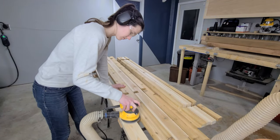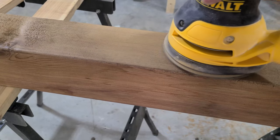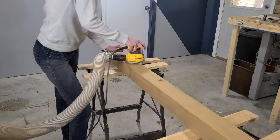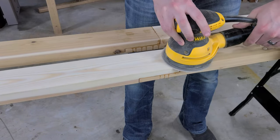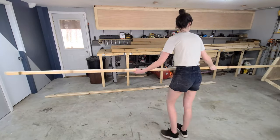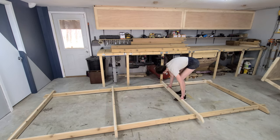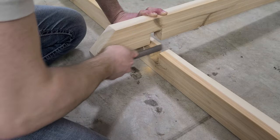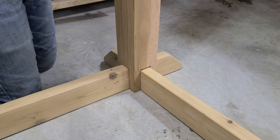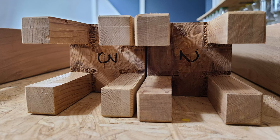These cedar boards have a lot of roughness that needs to be cleaned up. Luckily, our 3M extract sandpaper makes sanding much faster. We toss some of that on our random orbit sander and get to work. The finish we are using doesn't require you to sand to a higher grit, and this sandpaper does a remarkable job at producing a smooth finish, so we only sand up to 120 grit. Once all the boards are sanded, we do a dry fit of all the joints — some are a little too tight, and we want this to be easy to disassemble each winter. A little quick cleanup with the rasp and these half laps go together perfectly. Then we drop on the post and everything is a perfect fit. Don't forget to label those joints so you know how they fit together later.